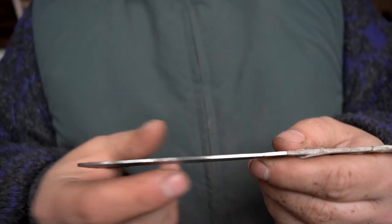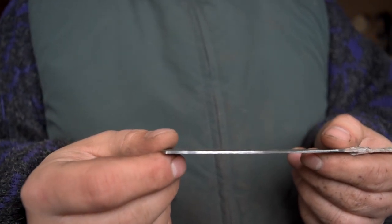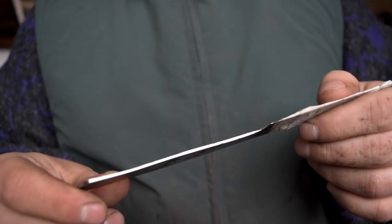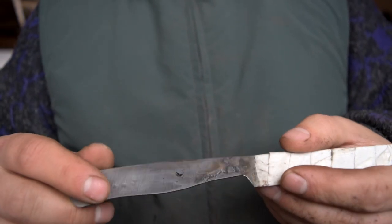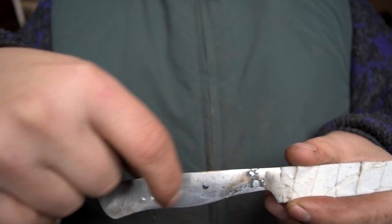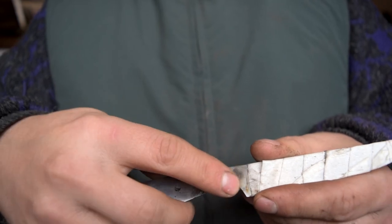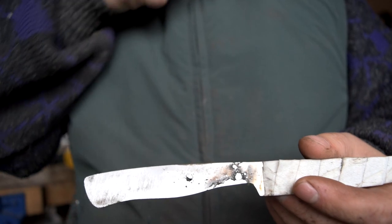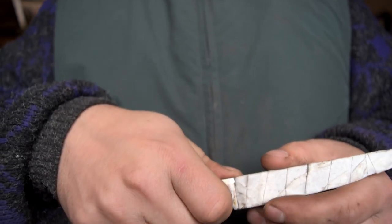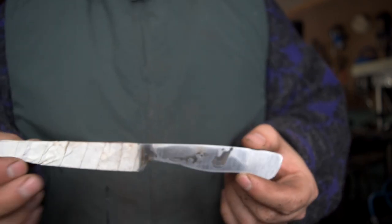The important thing is that you get this edge smooth. There's no break in that tang, so you would never know once the scales go on there that this wasn't a full-length tang. Same thing goes for the inside. I also filled in the previous pin holes because we'll want to arrange those back a little further. I also built this up a little bit right here — it was a little thin at first, so I built it up with a little bit of weld, just so it's got a little more meat and doesn't come too slender. Now we're going to be flush with that, and I think this shape looks good.